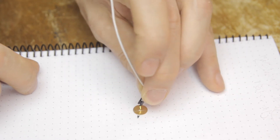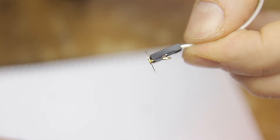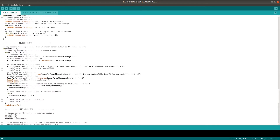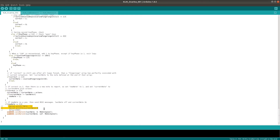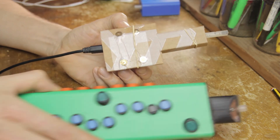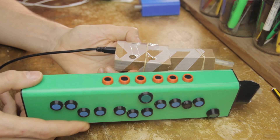And if you use my thumbtack method of key construction, this will stretch the header out a bit, sometimes damaging it outright if you're not careful. Finally, if you're used to Arduino code, you'll find a bunch of commented-out serial print statements in the code for the Ocarina. Uncommenting these will give you access to a whole lot of debugging info, which can help you solve many kinds of problems. I won't explain that further in this video, but there will be some videos coming on the channel which dive deep into the code for all these instruments, so stay tuned. For now, you can download the code from the link in the description and have a look at it yourself. The failure modes for all the Qlik wind instruments are basically the same, or at least very much alike, but the Ocarina is an especially good place to learn how to recognize and fix some of these problems, because it has so few sensors to deal with.